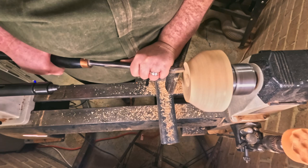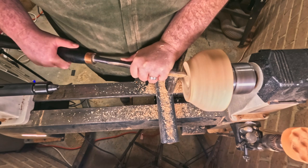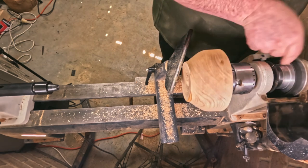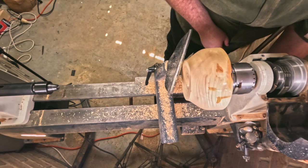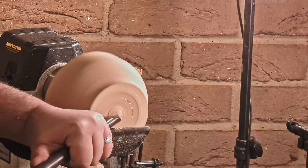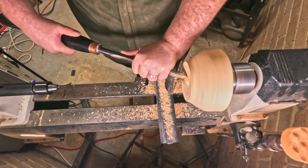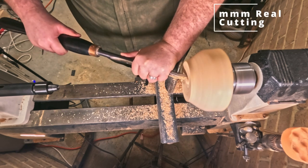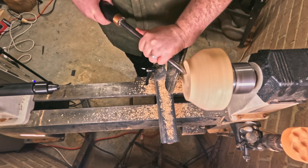I'm considering a tool sharpen and at the same time noticing this isn't cutting very well. So I decide to do a belt swap from low speed high torque to medium-medium, which will give me a nice range up to 1800 RPM. I started somewhere around 750-800 RPM. And as you can tell, it's already starting to cut a bit better. Let's turn on warp speed — cranked straight up to 1800, and as you can tell straight away, it is cutting beautifully.